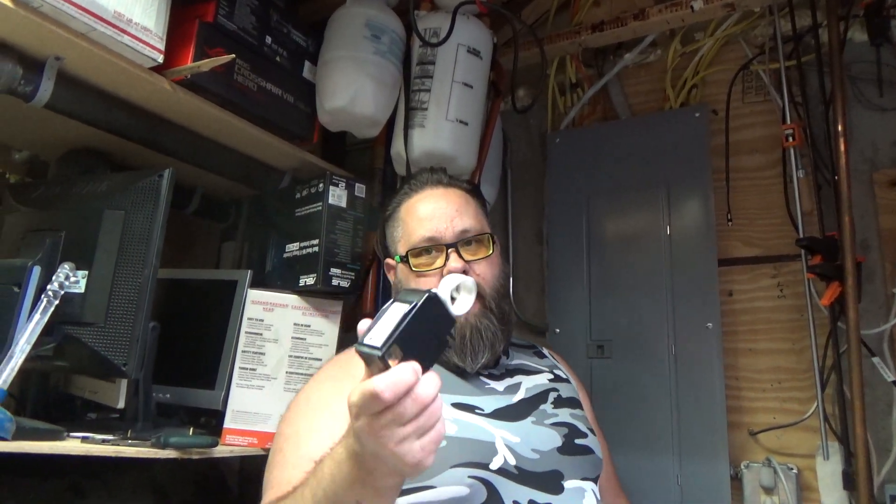What this is, is just like a breaker you put in your house, in your panel, except there's a wire that goes to neutral in your panel box. And when a lightning strike hits, it grounds off both phases of your power to the neutral of the wire. The idea is that it will protect your house from damage.